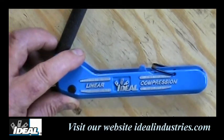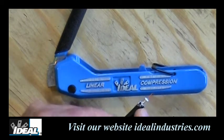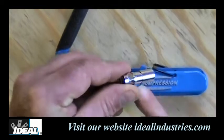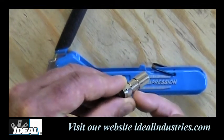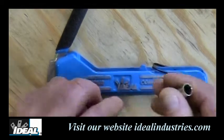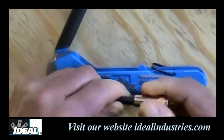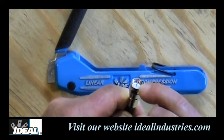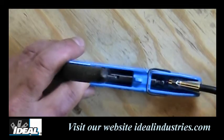In order to put a connector on the end of a piece of wire, we'll take a piece of RG6 and do a two-step strip like you normally would. Make sure you fold back all that braiding on the connector cabling. In the compression style coax connectors, you'll see a sleeve in the back — that sleeve is going to get pushed forward until it's up against the round part of the back end of the nut. We'll simply insert the cable into the back of the connector, making sure the white dielectric is flush with the opening in the bottom of the fitting. Then the center conductor loads right in through the opening in the front of the RAM.